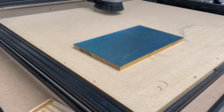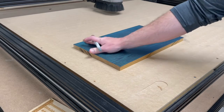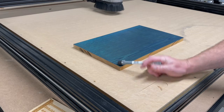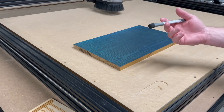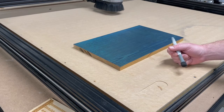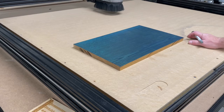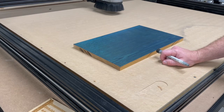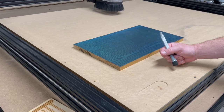Here's where I'm probably going to lose most of you, unless you're already savvy with CNC. Your carve usually has two reference points — it's going to be either from a corner (lower left is the most common) or it's in the center. If you have a bit change, it's best to set the location where you're not going to carve. I was doing the center, but I blew everything up and had to move things in. I'm worried I won't have the right Z height, but the second bit is a profile bit, so if it cuts down into the table a little, I'll be all right.